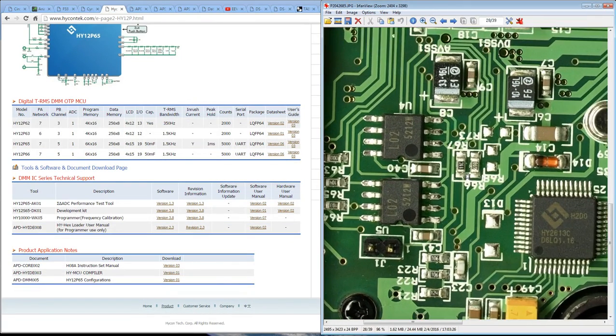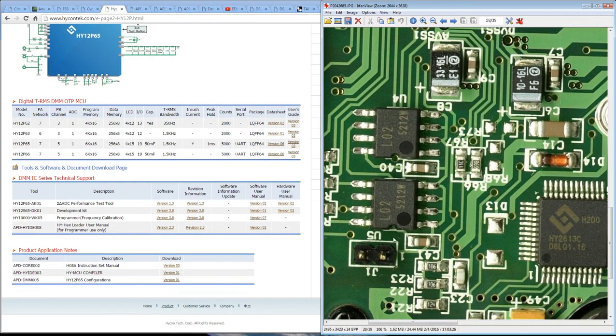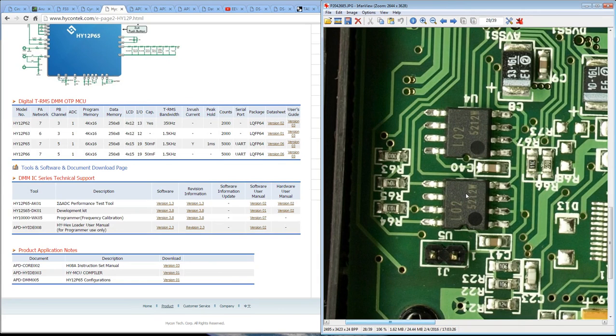Now, I'll tell you what, these two chips over here, U4 and U5, look interesting. Look, 8-pin SOs, and you'll notice that these 4 pins over here are all tied together like this. It's almost as if they're addressable pins, set an address. This one has 3 pins tied, the other one's going off somewhere else. So that makes me think that these are I2C devices.